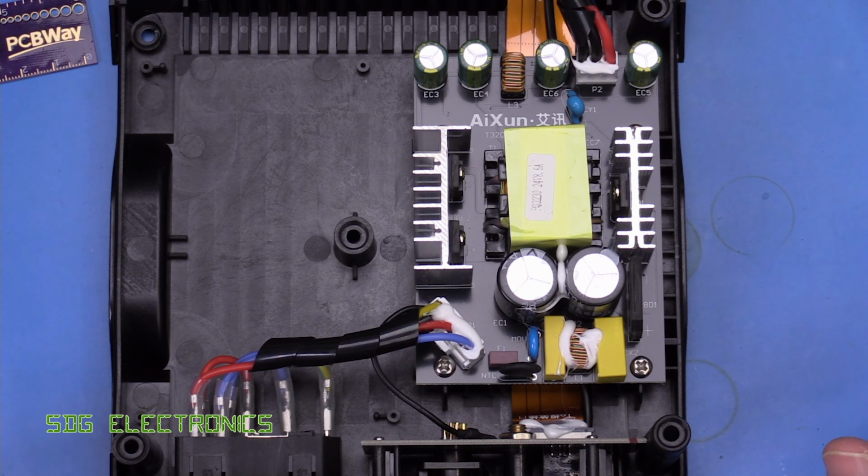So here's what the front of the unit looks like. Now we've got the connection here, which goes to the cradle that detects that the handpiece is in place. We've got another connection here, which detects when you're pushing a tip into the soldering iron. And then there's also a couple of wires here which go to that metal pad. Now that isn't actually an electrical connection, that is a thermocouple that is connecting through here onto the PCB.